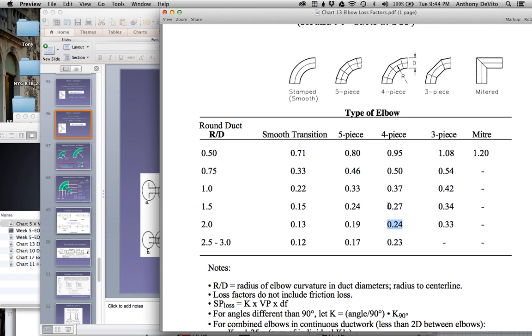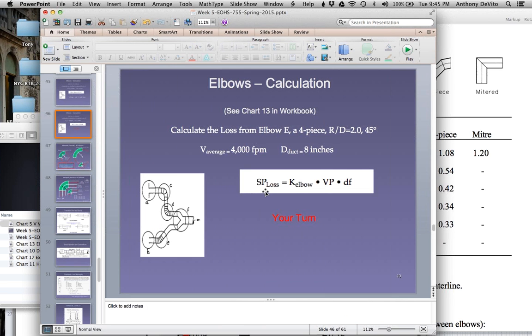Now, do all these calculations, these K factors, these calculations for static pressure loss, look like precise, exact calculations to you? Probably not. They make a lot of assumptions. A lot of them are worked from general tables. So that's really what they are, estimations. But they help us. They're tools that help us figure out the most likely sizing we need for the ductwork, the fan, the components, and so on, to achieve what we want, which is ultimately to get the capture velocity we need at the end and keep the air moving so we can get it out of the building.